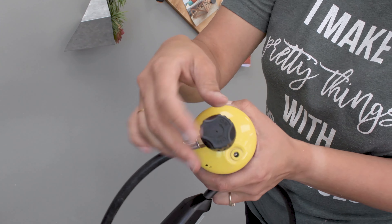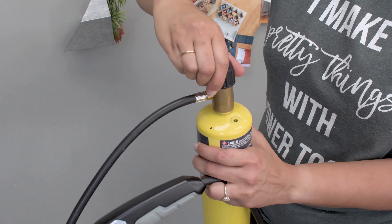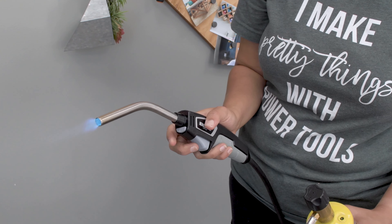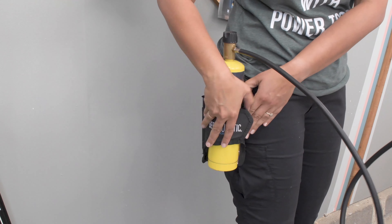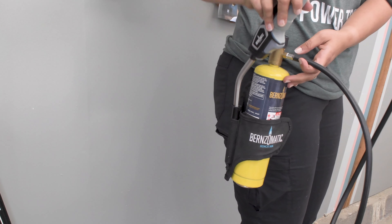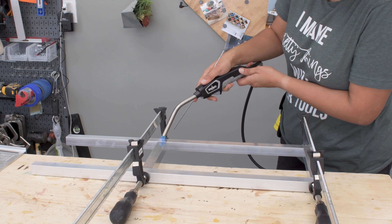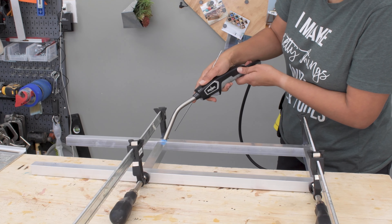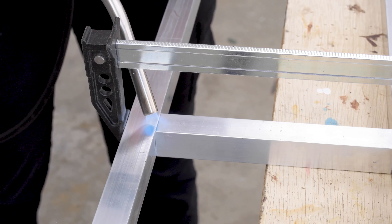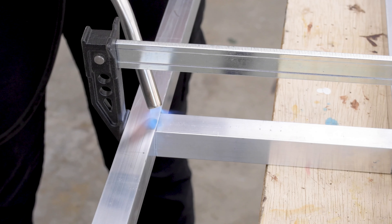Now let's get ready to set everything up for the brazing. I am building all the vertical dividers first. I do have only two clamps, so I can only do two joints at a time. I made sure that all the corners were square and then went ahead and clamped them. Only one end of the clamp is metal, so I turned it around such that the joint with the metal side was overhanging from the workbench by about six inches.